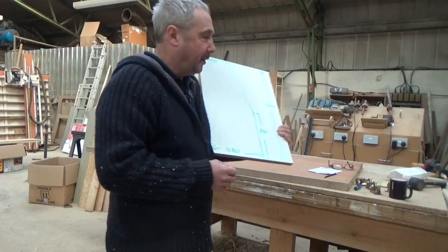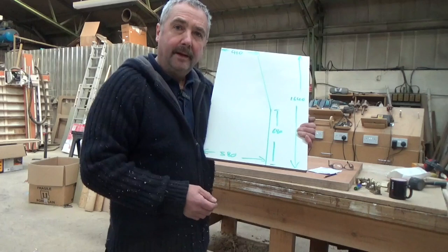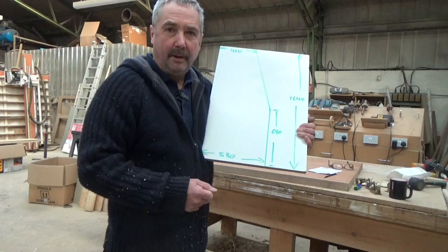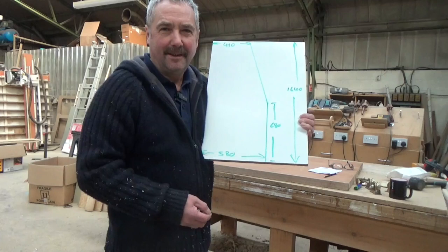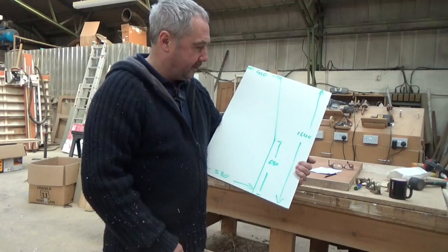So I'm going to draw it out on this door blank, and then we'll increase the width and the depth so it fits behind the pocket, so you don't see it when it goes away. But when it closes, it goes past the opening, and we can put a sliding door locker and everything, pop a lock with a non-snap Euro cylinder on, a bit more security. It's also a 44mm fire door, so should something go amiss, at least if that's closed, it's going to give a fighting chance to stop any fire spreading from the engine bay. You've got to come through a steel wall as well, but that's just an added bit of security really. Anyway, mark that out on this blank, and then we'll cut it all out.